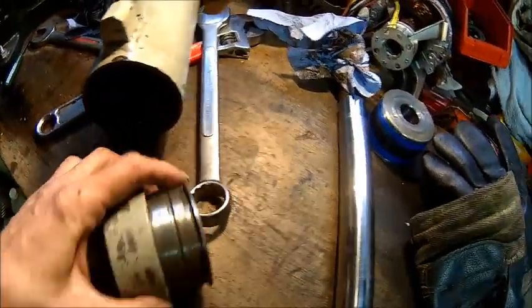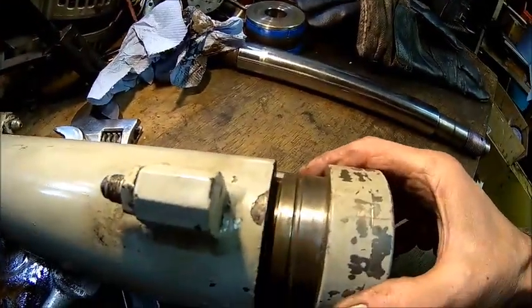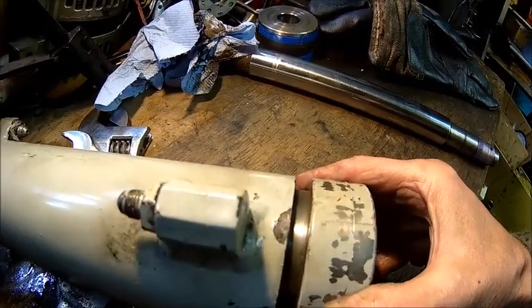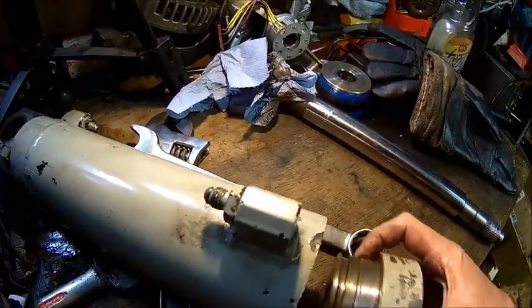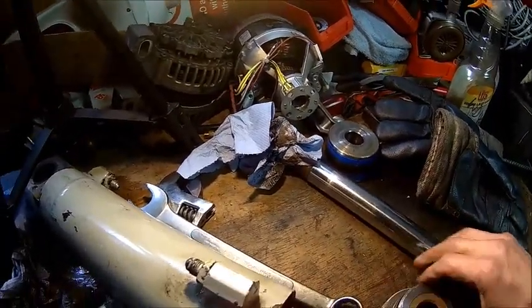So we polished the outer diameter and it looks good. It fits, but it's binding. There's less play here, and then you get it in and you have a hard time getting it out. There are a lot of burrs inside. There are no burrs anymore on this one, because we took them all off.